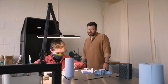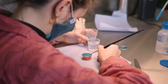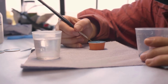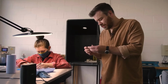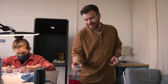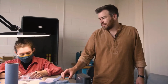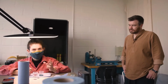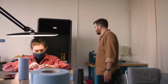Sally is making a fume dial here, putting the transparent enamel on wet with a paintbrush. This has not been fired at all, as Sally's just said, and it's ready to go. So you dry that a little bit first. If you put the wet enamel into the kiln, the rapid heating can just cause the enamels to blow off. So yeah, that's going in.